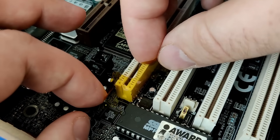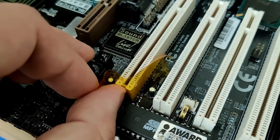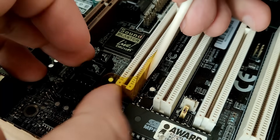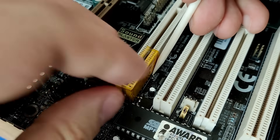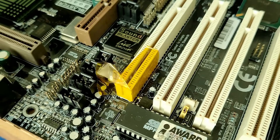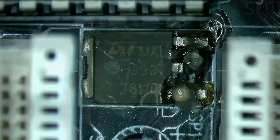If you are in a tricky situation like this, then you should do what one of my Patreon members suggested: cover plastic or anything that can potentially be destroyed by heat with Kapton tape. Unfortunately, when this information reached me I was already done, so you won't see this Kapton tape during my repair — but I would have had a much easier time had I covered the PCI slots with it.